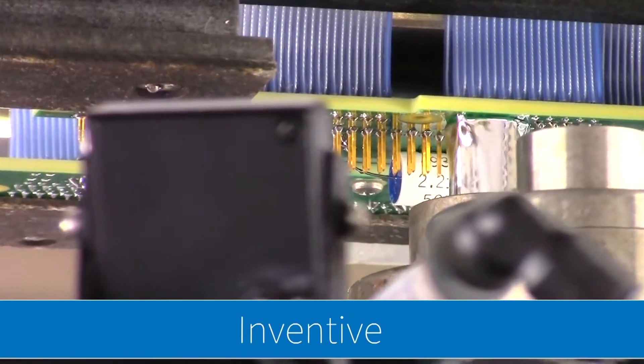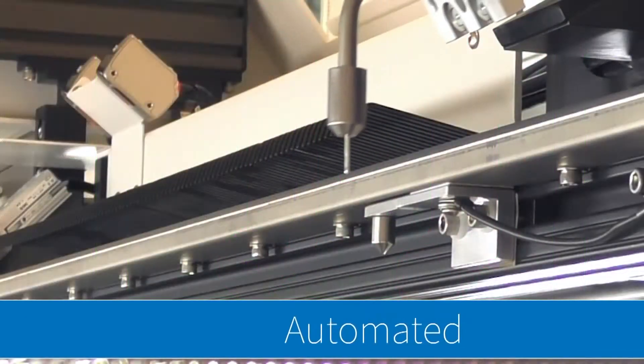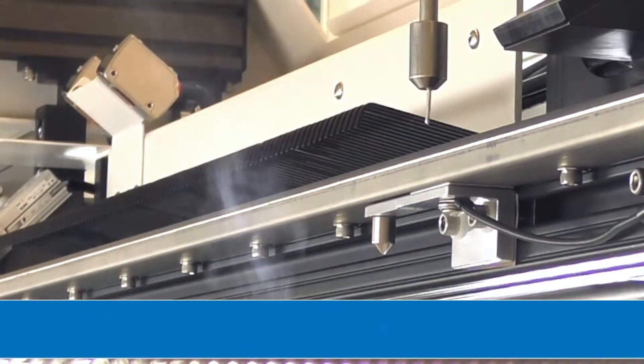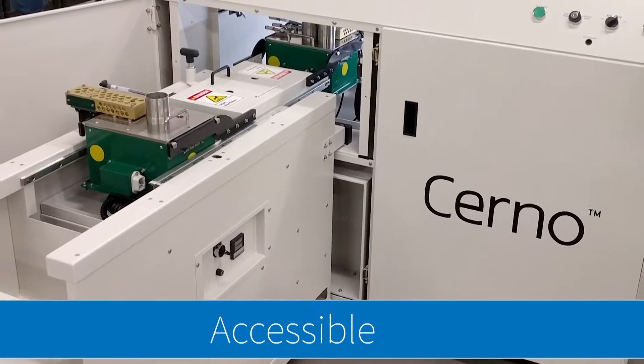This machine has a two-pot configuration. Originally it was built for people who wanted lead and unleaded alloys on the same machine at the same time, so they could reconfigure and run different products very quickly. The machine senses which alloy you have on each station and can double-check against the program. A second option is splitting the same-alloy work across both stations. One of this year's innovations is that the two pots can now share the work area to handle a larger board, with software intelligence preventing them from colliding.